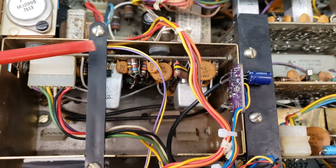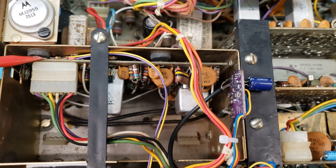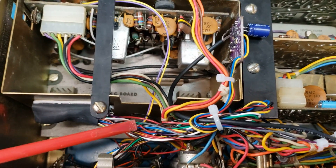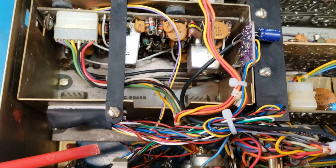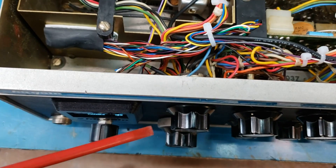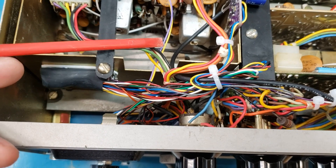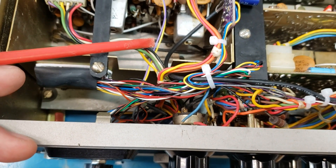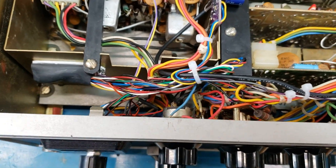These two wires come back here and they are sitting against that rubber piece so it's not going to short. Those are for your sideband — it'll let you know upper sideband and also AM. It runs over here to the Arduino. By default the kits are on lower sideband, so we only need two wires. If we bring this one low it's on AM, if we bring this one low it's on upper sideband, and if neither is low it defaults to regular lower sideband.